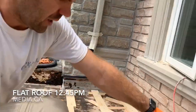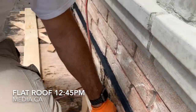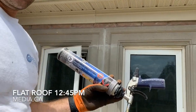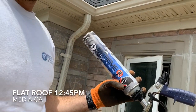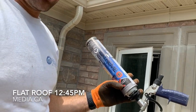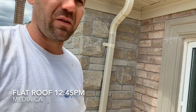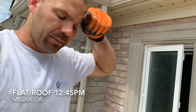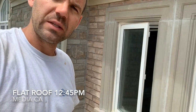I also noticed a quite big gap — over an inch — between the house and the plywood, which is really kind of ugly. So I've got expansion foam here, called Extreme Weather — I've been using that for windows and doors. I'm going to fill up that crack with the foam, which will give me extra protection for water in case it gets in there. Because it's soft foam, it'll allow movement between winter and summer, so the porch will be able to move accordingly. Once the plywood is in, I'll start on the shingling. Stay tuned.